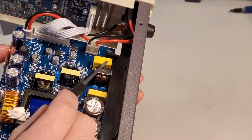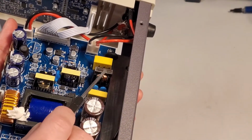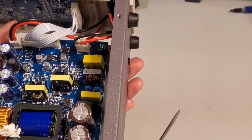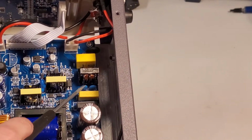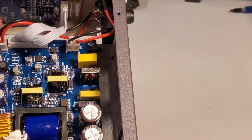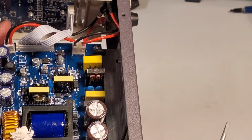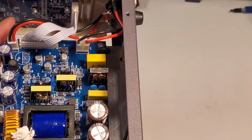This is an X capacitor here. It's most likely across line and neutral. Then we have a common mode choke here. Decently sized. Sometimes these are really undersized. We have 2 small, I don't know if they're actually Y rated, but I'm assuming those capacitors are to ground. And another X capacitor. That is a pretty typical EMC filter.